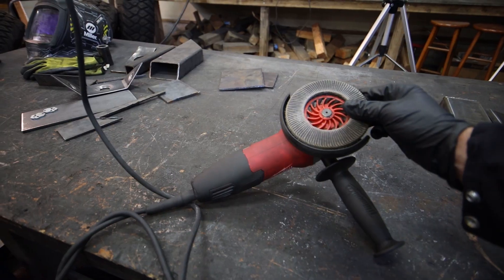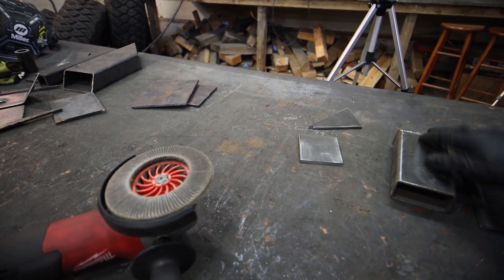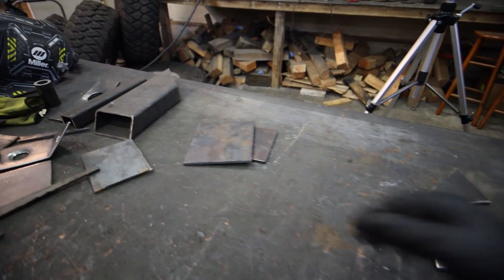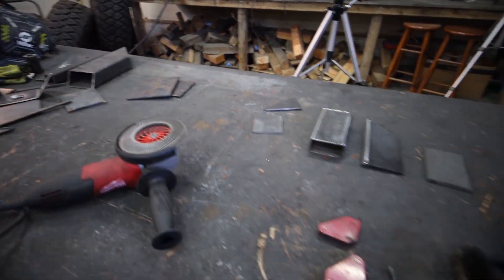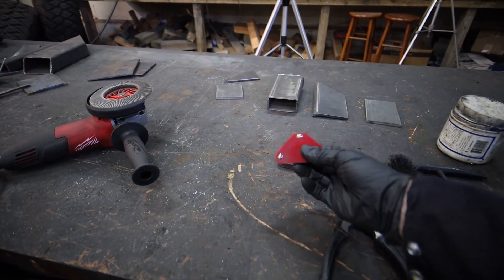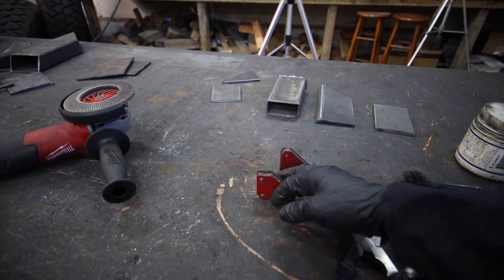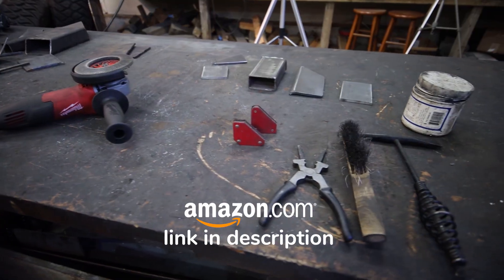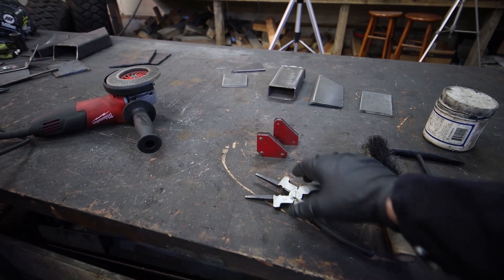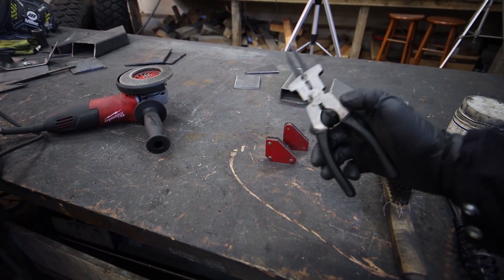You need a couple of basic tools. This is an angle grinder with a flap wheel. The flap wheel is nice because it doesn't dig down too deep — you can just put a polish on all your edges and everything that you're going to weld. The cleaner your weld surface, the better quality the weld is going to be. Now you can stick plenty of dirty stuff together, but since you're going to be practicing, I'd recommend cleaning the surfaces first. The other tools I'd recommend are some of these little 90-degree magnets — really handy for a number of different instances and you can get them on Amazon. Also get yourself a set of welding pliers. You can snip the wire with them, and they're the right size for the tip so you can undo the tip if it's bound on there, and the right size for the nozzle too.